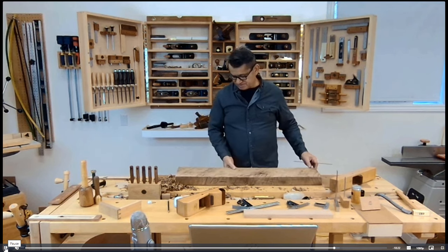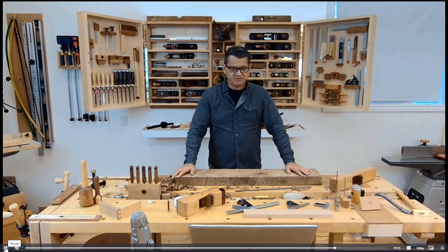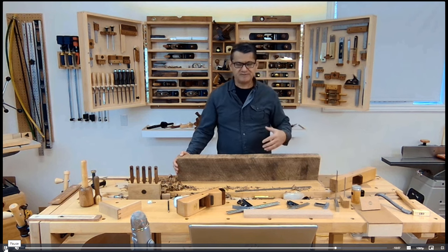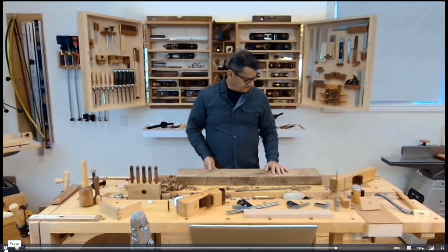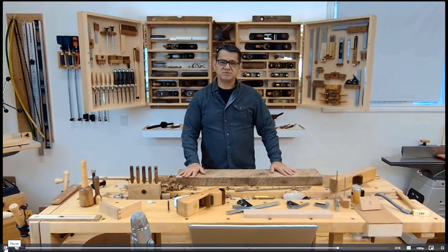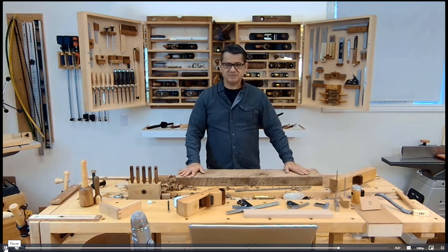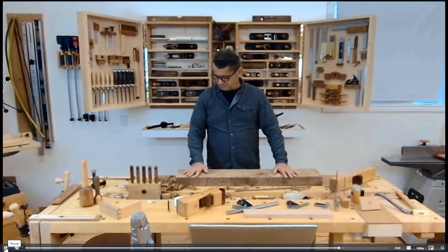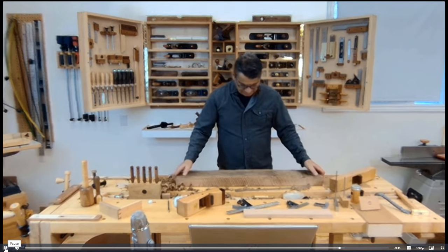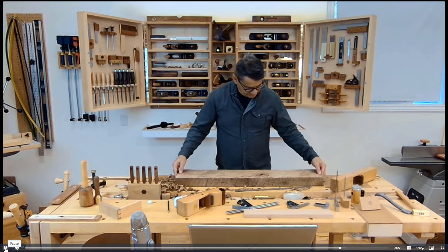It's quite labor intensive because you're not only making the surfaces smooth, you're also bringing it down to thickness. If you need two inches and the board is two and a quarter inches, imagine the amount of hand planing required. A machine thickness planer will shine at this. I tend to use hand planes mostly at the latter stages, unless it's an exceptionally exotic wood. This particular board has a little rock — I need to find where the high point is and eliminate it.